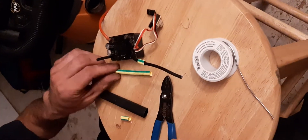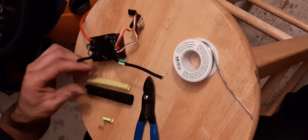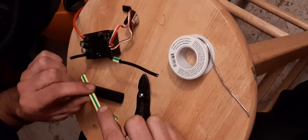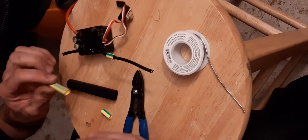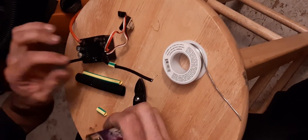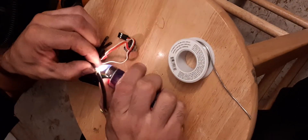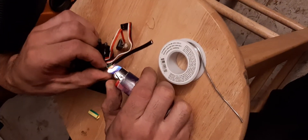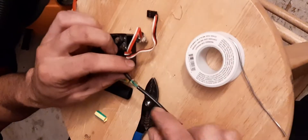What I use to shrink this stuff down with — this is some automotive shrink tubing. I just grabbed some tubing from work in different various sizes. This all has glue on the inside. You do want the glue, especially if you're going to do a waterproof rig, a boat, or anything like that — or if you ever accidentally drive into a puddle. I want my stuff to be as sealed as possible. So you take your shrink tube and you meld it down just like so. See how it's pulling itself into that joint — it's pretty much the same diameter as the wire already. This should make it so you don't have a whole lot of problems going through your cases.